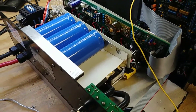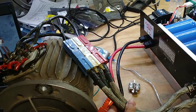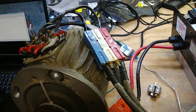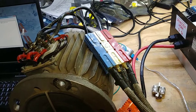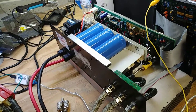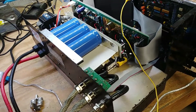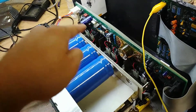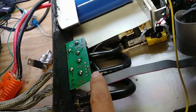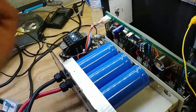We had no shorts into capacitors - that's all fine. So I'm not sure what would actually cause this thing to have popped the fuses. It could have been the motor. It's got all this gunk in it, but that's dielectric compound to keep it from corroding. It's possible that the motor this typically drives has a problem, and I'm hoping they can check that out so if they plug it in, it doesn't just pop the drive again. Typically the saturation detect on the IGBTs can catch a short circuit and shut it down. We've got the current sensors over here - they can read that there's a problem and shut it down. So it could be just that the fuses were old and they popped.